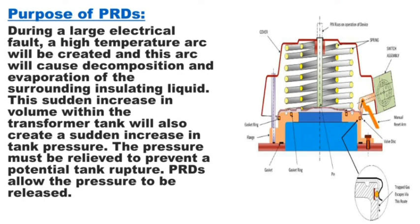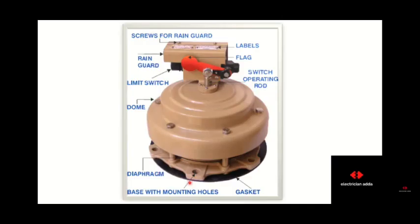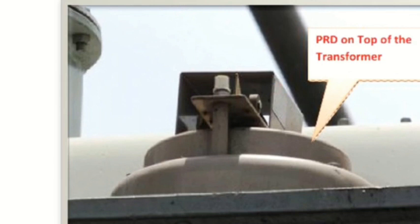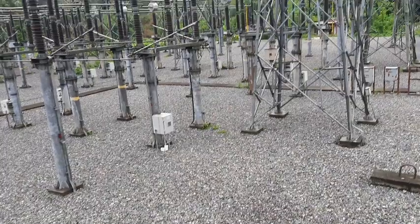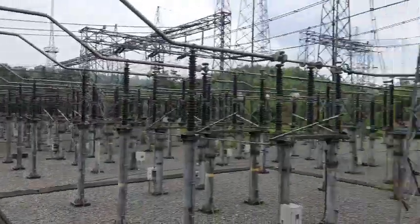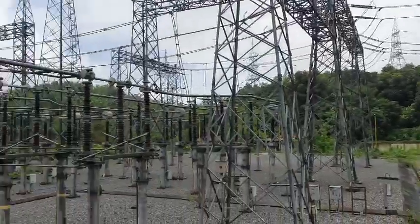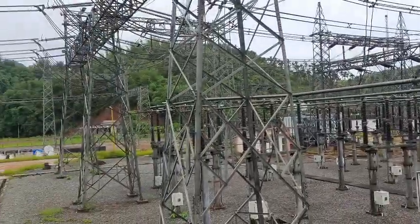Except in the NGR, only one relay or one PRV is enough for protection. But normally in all substations, in all power transformers, we're using two sets of PRV. This substation is 400 kV by 220 kV on that side, and 132 kV on this side.